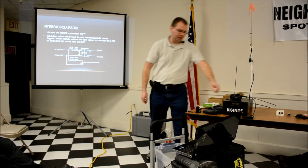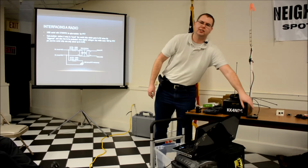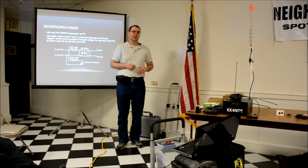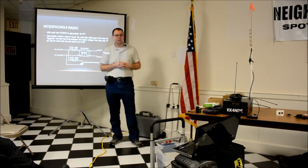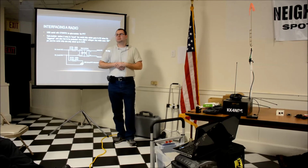For internet, I use a Verizon Jetpack because hotel Wi-Fi seems notoriously unreliable at places I've gone. They like to block a lot of ports, and Echolink requires you have certain ports open. If I bring my own internet, I know what I have. And it's USB, so there's no wireless to get jammed or anything. How do you like the Jetpack?